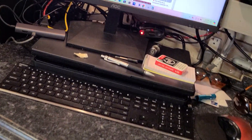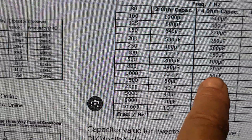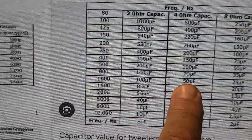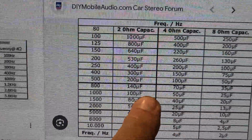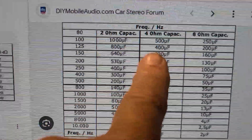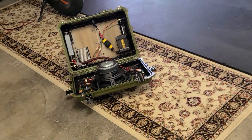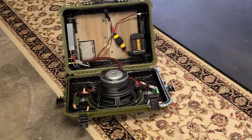Let's go over to the computer and look at the chart online. Right now I have a 50 microfarad capacitor in there. If you look at the chart, that puts us at a thousand Hertz because I'm on a 4-ohm system — so it's about a 1000 Hz crossover. That's all fine and dandy, but how do you knock the power levels down?